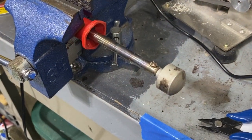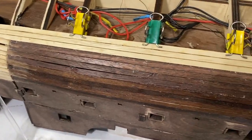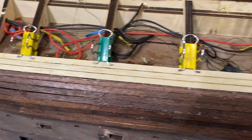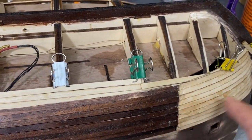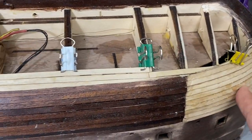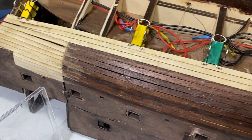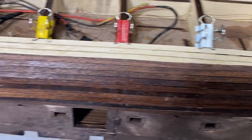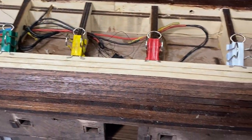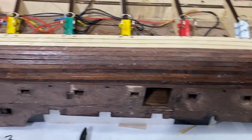I also have a heated plank bender and sometimes I will soak the wood. But with this lighter wood it bends pretty easy without even getting it wet, so just the heat has done very well in getting the proper bend. Sometimes the black walnut is a little harder to bend, so you can put that in some hot water or steam it in a rag. I had a suggestion of using a thermos with hot water so the water would stay hot — that was a good idea, I just don't have a thermos.